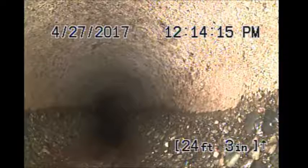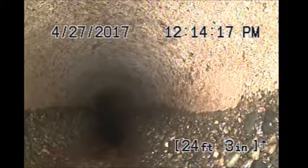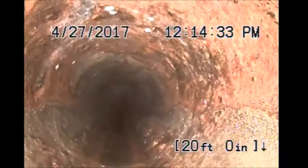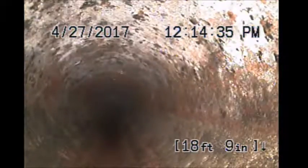About 5 feet. Replace about the first 5 feet of pipe out there. It's only going to be a foot and a half deep, and it's going to get rid of two cracks. Clean out on it, pointing downhill. Biggest issues are going to be basically what's located between two properties, I think, behind this house.